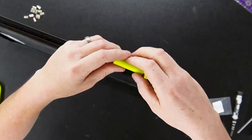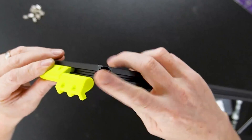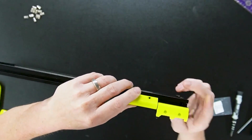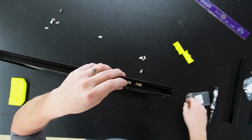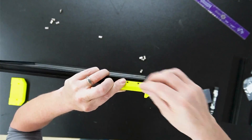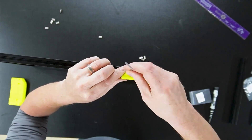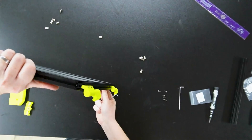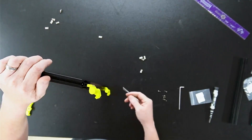The bottom side is a little bit different - you don't want to slide it down to the edge, but you want this part to be flush right here. Put your t-nuts in this orientation, get something to stick in the hole to make sure you're in the right spot, put your M3 by 8s in, then slide it down until it touches right here. You can do this by standing it up and sliding it down until it won't go any farther, then tighten it up.